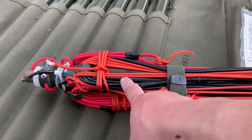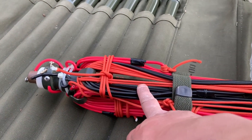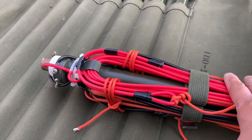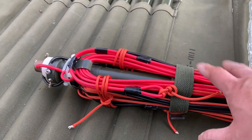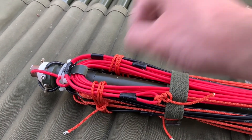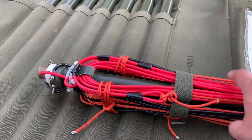The black wire is working at 14.24 MHz. The 20 meter band SWR is not great — about 1.5 — but the 40 meter band red wire is around 1.0. The total length is around 36 feet, making it almost a square. When I put this pole in the center and tie the rope to the stake, it forms about a square at a 45-degree angle.